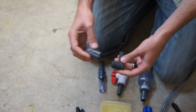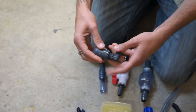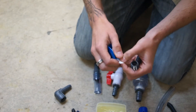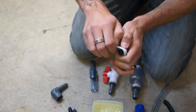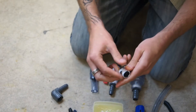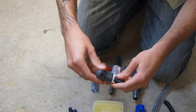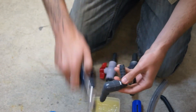Taking these two pieces as an example for a simple plumbing part connection, the first thing I want to focus on is using Teflon tape on the threaded screws. Teflon tape is important for preventing leaks — when head pressure is applied, water goes where there's least resistance, which is out of the threads. You want to wrap a few times around the whole threaded area and make it pretty thick, so that when you connect these together it makes a really nice seal. Then use vice grips to tighten it nice and snug.